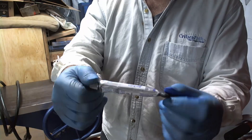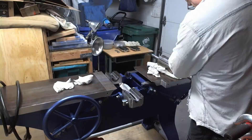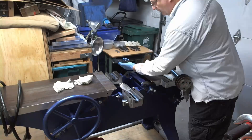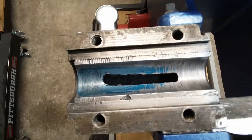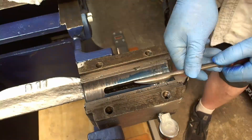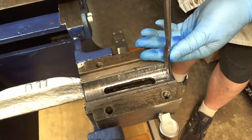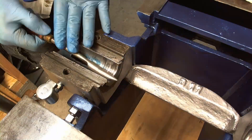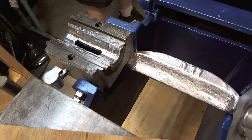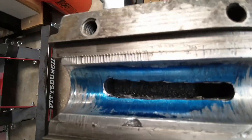I'm going to use the Prussian blue that I got — I had fixed a tube for it — and that turned out to work really well. You do have to have enough of a layer for it to have an impact, but that worked out. After the first one it's not very full coverage. So I use the Babbitt scraper I got on eBay and go through both sides. I tried to make a groove along the edge — we'll see if that ends up working later. After the first round, coverage on round two is a little bit better.